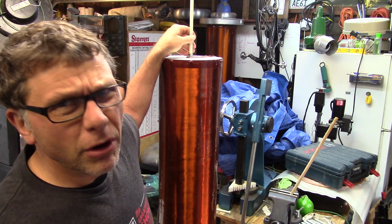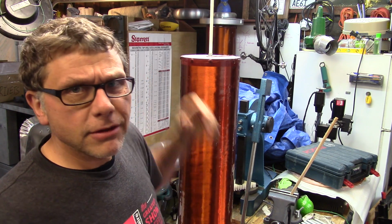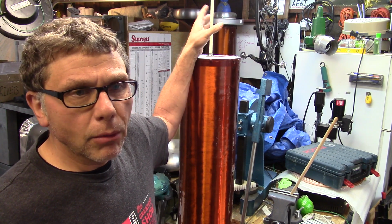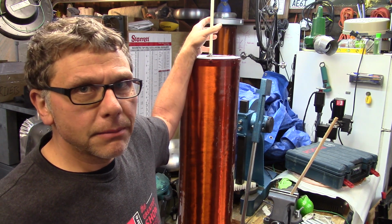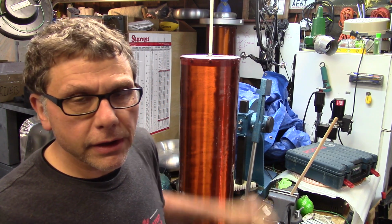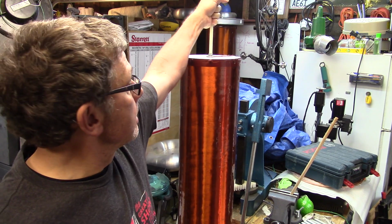It's 6 feet long. It's 1/2 inch by 13, and you can get this. I got this at small parts from Amazon. I mean, you can get them pretty much McMaster-Carr. You're not going to find one at a hardware store in plastic. You'll find a metal one, steel, but that's not appropriate. It's not appropriate to send a steel rod through the center of the secondary. So this is inert electrically. It's 6 feet long. It's threaded.